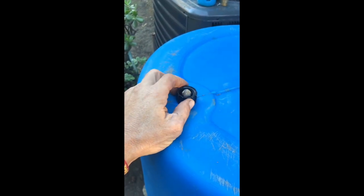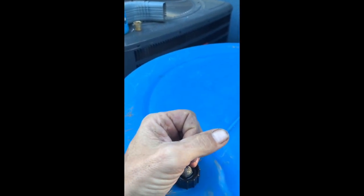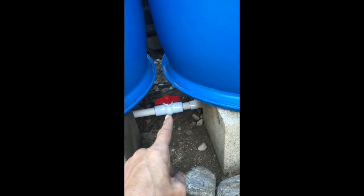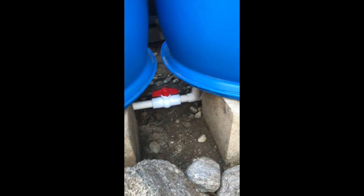This is a small air valve — it's like an irrigation filter type fitting. You can actually put a hose on here and fill it up with fresh water during the summer when it's not raining. These systems also have an isolation valve so we can do repairs. There are also unions here so we can repair each barrel individually and take them off without having to dump the water from each one.